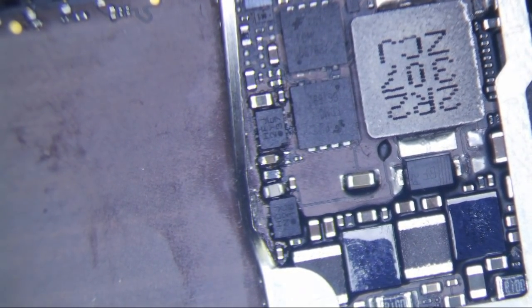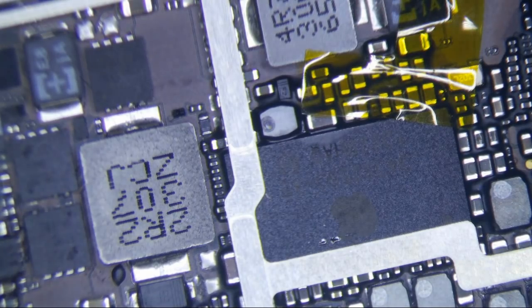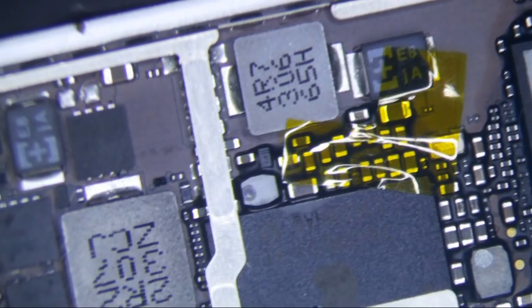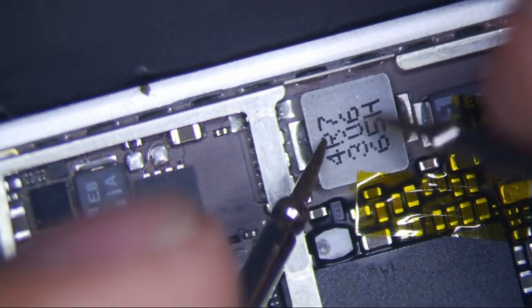I know the backlight system has a backlight filter, usually a coil, and usually a diode. So I looked at the schematics, and I've never actually replaced the diode on this one before. The diode is hidden under this little thing right here; the coil is right here.